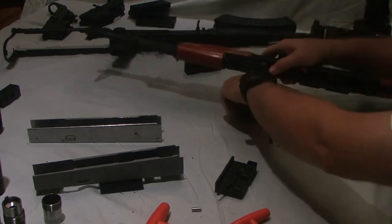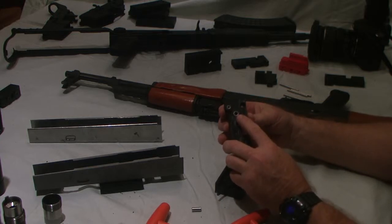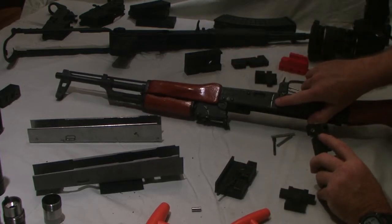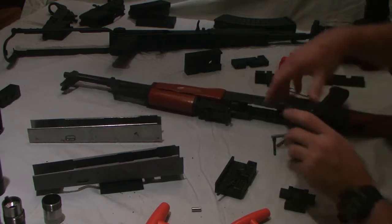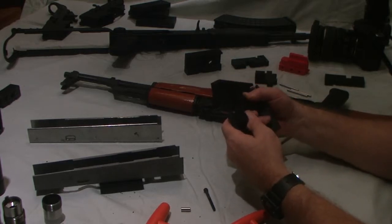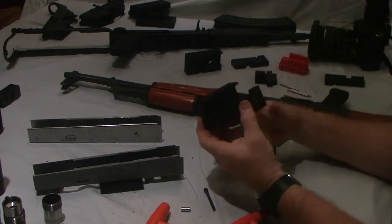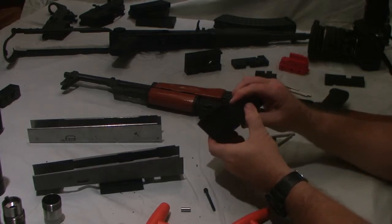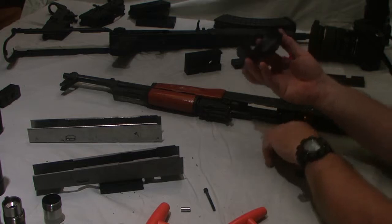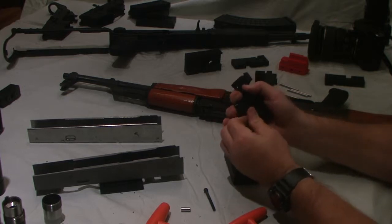So those are the components. When it's just sitting without the pins, you'll have your right side plate, which has your auto sear 5mm hole. It also has your 1/8-inch hole to put in the new detent mark — you can see where I touched it with the drill. Your left side plate. And then this is in the center. So now you have a nice tight capture, and it's square, so there's no way for it to skew.